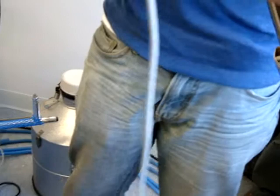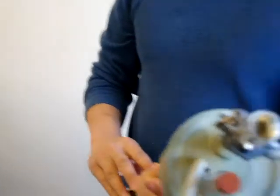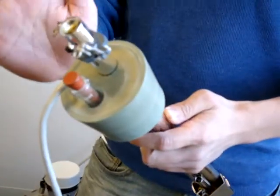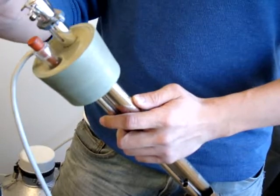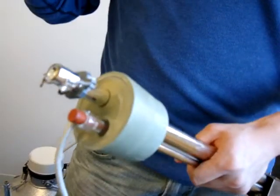put the evaporator in. So the way this thing works is that there's an internal heater, which is located right here, and based on whatever temperature you set, it'll increase or decrease the heater unit here so that it pushes nitrogen through. So it's just less nitrogen. Right. So the more heat it applies, the faster nitrogen is getting pushed through, and the higher the temperature. I will show you. Because you're forcing nitrogen gas. Right. Exactly. So there's actually two forces acting.